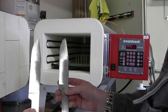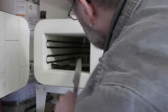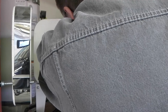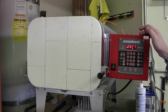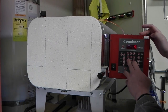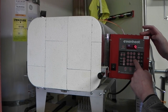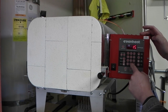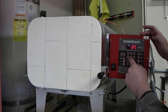Alright, we've got our test blades ground and ready for heat treat. I'm going to stick them in the kiln, turn it on and program it. Program seven, one segment ramp, as fast as possible. We're going to go 1,500 degrees Fahrenheit, hold for 25 minutes.